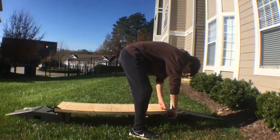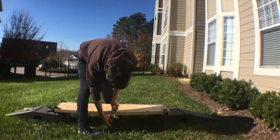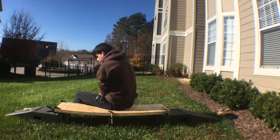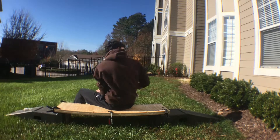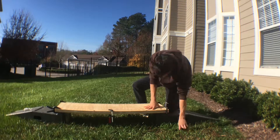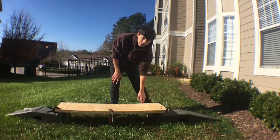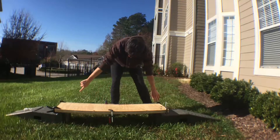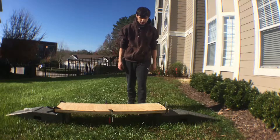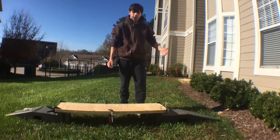Put the clamps right here, out at the corners, then just wait for it to fully dry up. Once it's done drying, I'm going to cut the big piece — using the edge of the smaller piece as a reference point to cut off the excess so the board is even. I'm also going to cut it down a little more to make it narrower so I can fit the wheels in later.